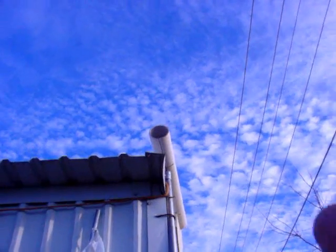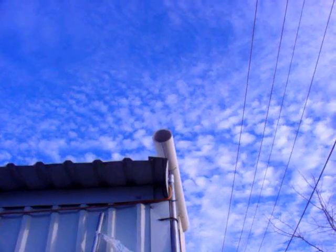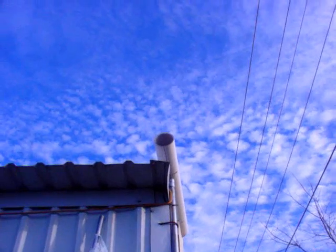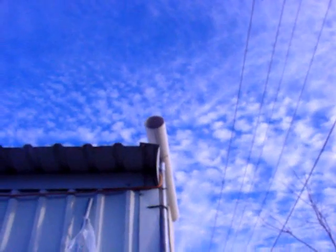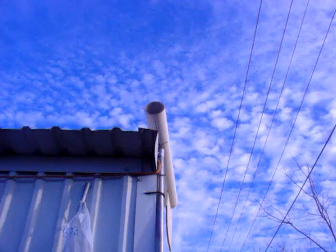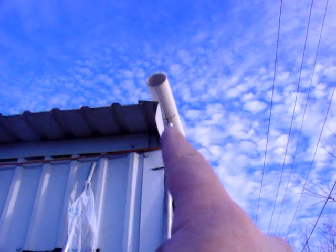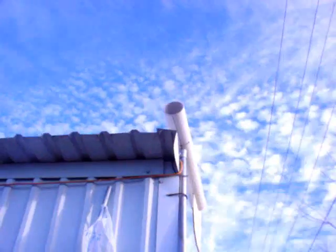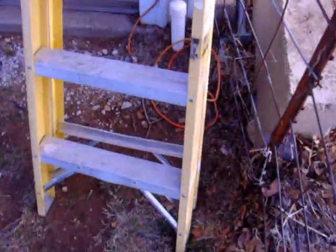The prop wasn't spinning. I went to see if it would spin up and my amp meter went all the way to the left — that's a little bit more than what this thing uses to spin it up. As I held it there a second the needle didn't start coming back, which means there was a short. So I lowered it down, disconnected the wires, separated the little gap at the very bottom of the PVC, and slid the motor out after I disconnected the wires.